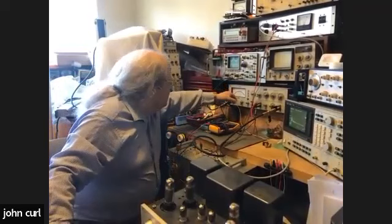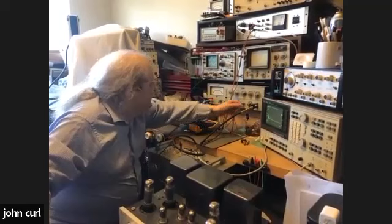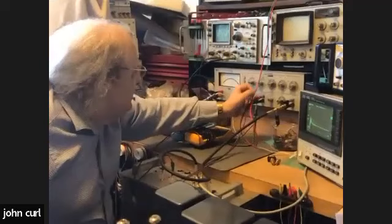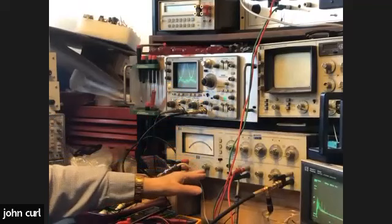Let's go to 10 watts. I set my input level again, and I have to do a couple of clicks. Click here. Click here, and I'm looking at, this is about 10 volts out now, and you can start to see real distortion starting to appear. So instead of being really driven hard, the distortion is getting above the noise, but it's still down in the mud. It's actually at the residual of my analyzer.